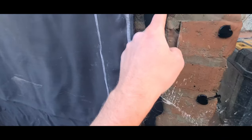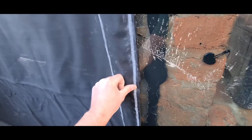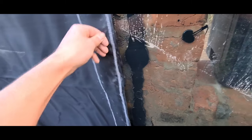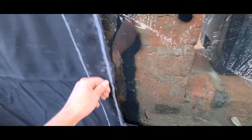As you can see, that is MS polymer as well. We glued the window in Thursday last week, it's Monday now, and the window's still there. So you can bond the glass directly to block work without any issues.